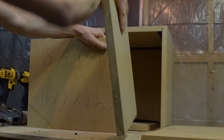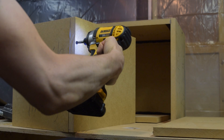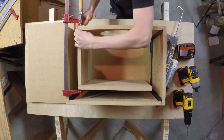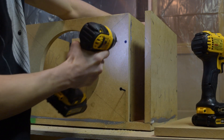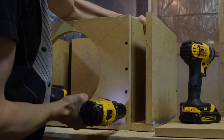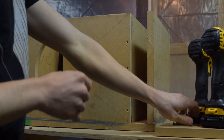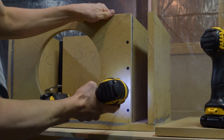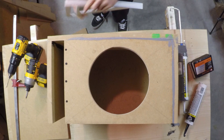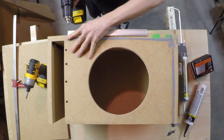Next I'll assemble the port walls together with the longer one overlapping the shorter one as shown in my design, using only 2 screws. I'll place the port wall into the box, line it up with the front, drill 2 holes, apply the glue, and screw it together. The lower screw started stripping out so I had to add 2 additional screws. I forgot to apply the glue to the bottom of the port wall, so I removed it, glued it, and reassembled it. I used the rafter square to make sure the port was straight, then turned the box over and used the rafter square to figure out exactly where the port wall is located on the bottom, using where the port wall meets the front as a guide.